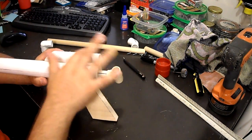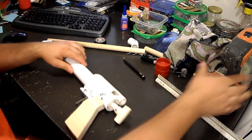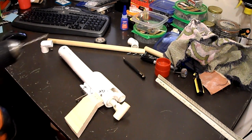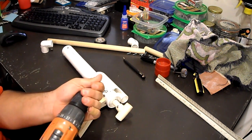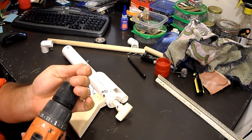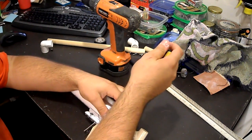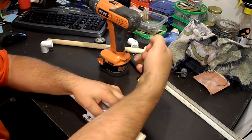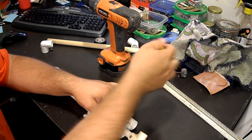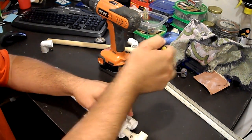Now that this hole is cleaned up and the hot glue is heating up, I'm going to show you how we're going to mechanically fasten the stock. We're going to need our drill with our 7/64 bit. We're going to take the internals out of our snap — open up the back, pull the spring and plunger head assembly out — just to keep it tidy so we don't get any debris in there or drill into anything we don't want to.